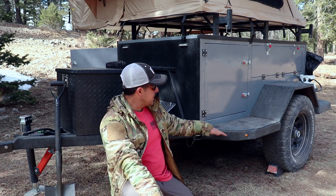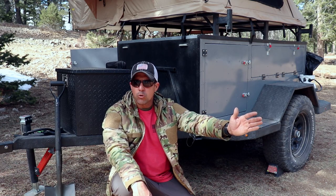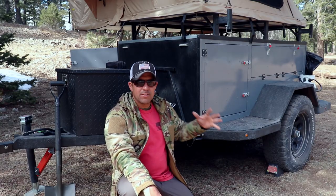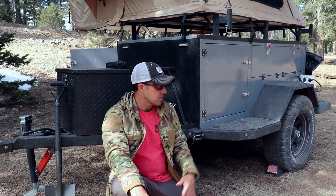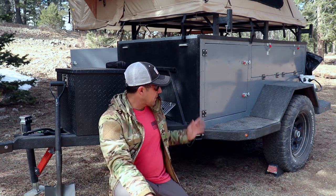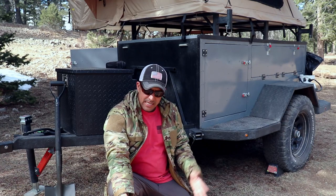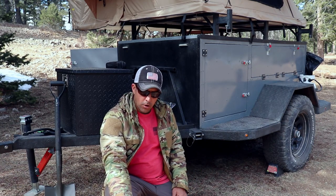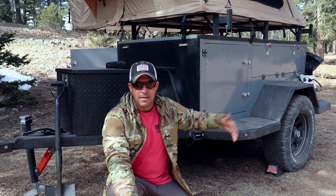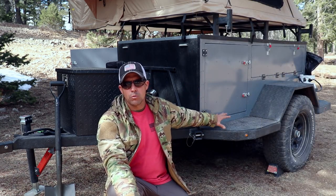First thing is going to be the chassis or the frame — that's the first thing I built. It's got a two-by-two reinforced beam down the middle, and then I built a rectangular shape around that. Once I had that all square — that's probably the most important part — I made sure everything would line up later down the process of fabricating this thing. Once that was squared up, I built out into the fender area and then forward into where eventually the tongue box would sit. I had no diagram for this thing, so a lot of measuring and making sure that everything would fit once the final product was done.